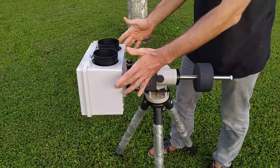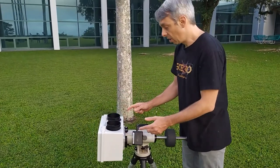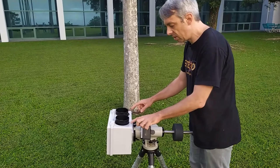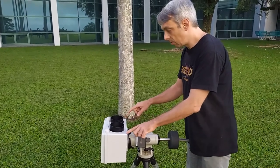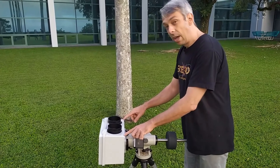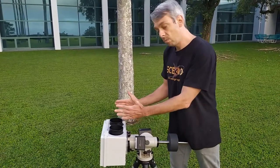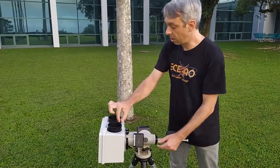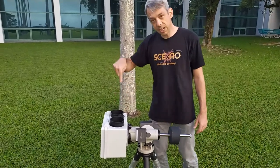It's much better — almost good. Now it's good enough that it's not rotating by itself. I want to do a very fine adjustment: tap it back and forth and see that it's equally easy either way. Now it's actually very good, but I'm not quite done yet. All I've done is slid it so that the center of mass is aligned on this axis, but it could still be off in the other direction.